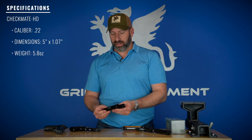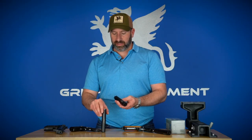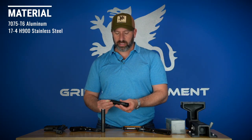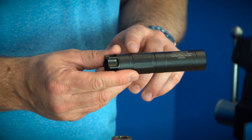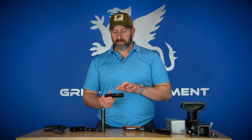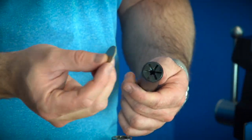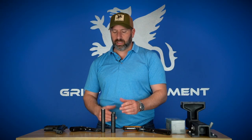Going into the specs on the suppressor, it's 1.07 inches — just a little bit thicker than the original Checkmate, but quite a bit shorter at only five inches overall length. 5.8 ounces is the total weight, because the silencer is made of 7075 aluminum, which is the high-grade aluminum. It's three times stronger than 6061 series aluminum, or roughly equal in strength to 300 series stainless steel. The high aerospace quality aluminum outer tube features some nice texture for gripping. The front cap is 17-4 stainless steel, nitrided, and features geometry that allows a quarter coin to take it down. The rear is also 17-4 stainless steel with the Easy Lock interface, DLC coated.